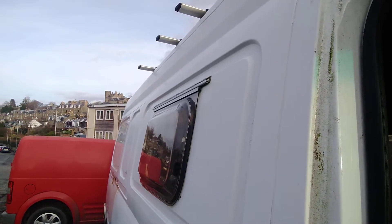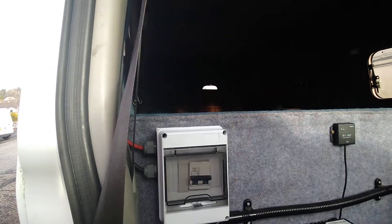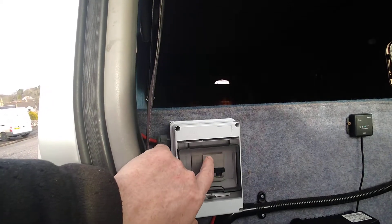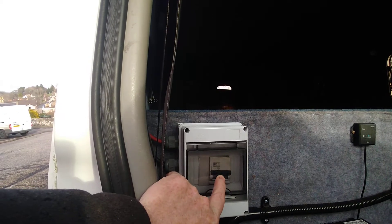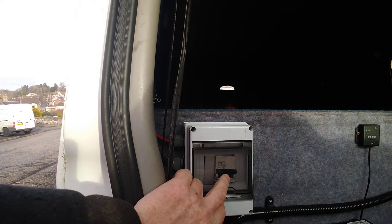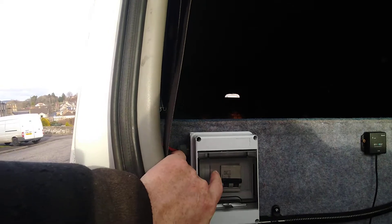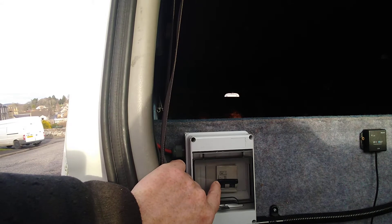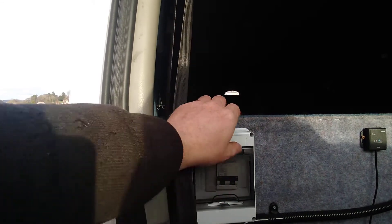Hello and welcome to another video. I just want to show you the safe way to disconnect your solar array from the rest of your system. What we're going to use is this distribution box as a disconnect. You always want to be disconnecting both the negative and the positive when you disconnect your solar array — the more panels you have up there, the more voltage and amps you're going to have, and you need a way to disconnect it safely.